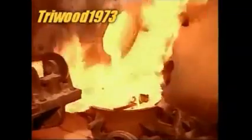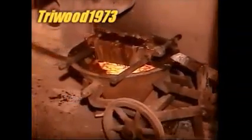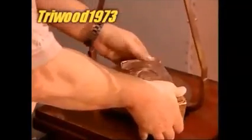By now, the gold has cooled slightly, so they reheat to 1,600 degrees Celsius, then cast it into bar-shaped moulds. The gold takes about four minutes to solidify, then another hour to cool completely in a basin of cold water. The gold bars are extracted from the moulds and cleaned of any slag residue.